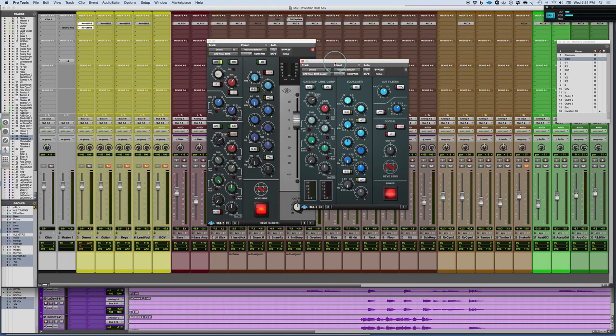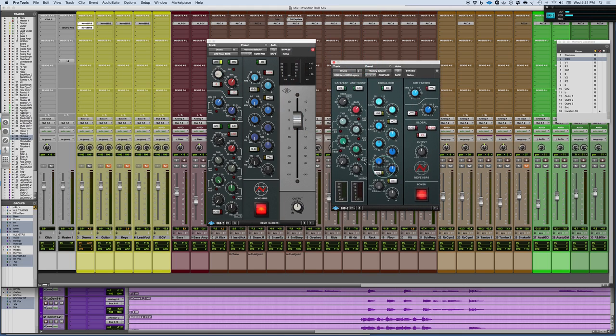What's different about the two is that while some of the stuff is primarily moved around, you have a whole input amplification section, and then you have a fader on the outside. You also have a meter here, which is added in, like a VU meter showing your overall level. Now, on the actual unit itself, there is a meter display. It's not a VU needle type of meter, but a meter that has a ballistic that allows you to set it to a variety of different peak or RMS settings, and it does have a VU sort of ballistic to it. So they're doing that without putting the analog meter on, because it didn't really exist on the original console.